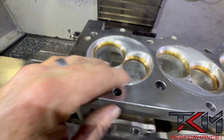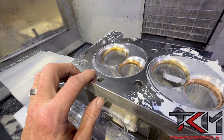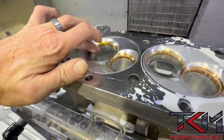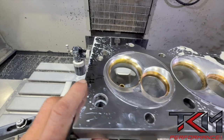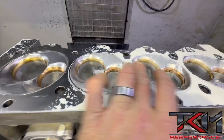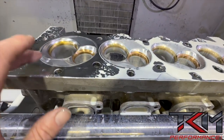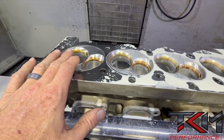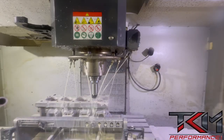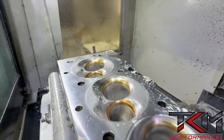Really nice — very happy with it. Once we get everything serviced up it'll look good as new. I ran it another two thousandths down doing the cleanup pass and ran it with cooling on. As you can see, the cooling made it pop a lot more, but there are nice radii everywhere — turned out to be a nice job. We want all the chambers to be exactly the same. We're going to run these other chambers along with this one so everything is uniform, because when you're running these motors on the edge, if one cylinder has just a little more compression than the rest, the tune is going to be different. So that's badass.